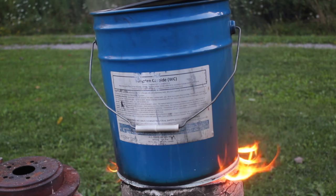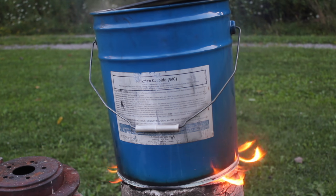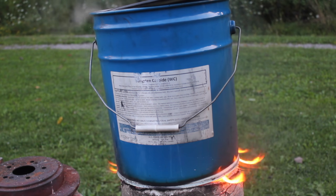Now I'll take a moment to explain what's happening to the coal as I heat it. This is a very similar process to making charcoal, except we're heating coal instead of wood. Coal burns hot because of its high carbon content, but impurities like sulfur and phosphorus make it burn cooler. Heating the coal burns out these impurities, but the carbon is left behind because there is not enough oxygen to react with it. Also, around 500 degrees Celsius, or 1000 degrees Fahrenheit, coal starts to release a tar-like substance which air cannot flow through easily. This tar will be released in the bucket, and when it is used as fuel, there will be no tar left to be released.